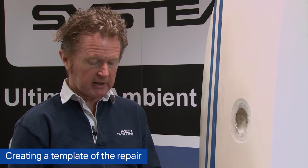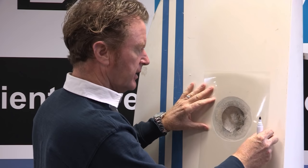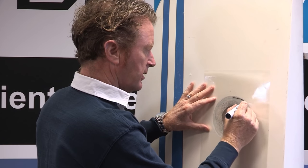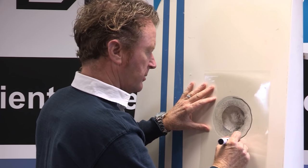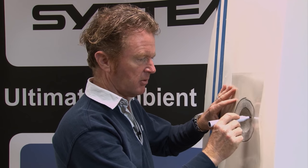Now we've taken the time and trouble to measure our laminate thickness at 2mm and grind the bevel at 25mm. Now we need to make an accurate cutting pattern, and we do that very simply with a clear piece of plastic. So here we are back with our repair. I'm now going to make a template. My template will cover the perimeter of my prepared repair and the hole itself.